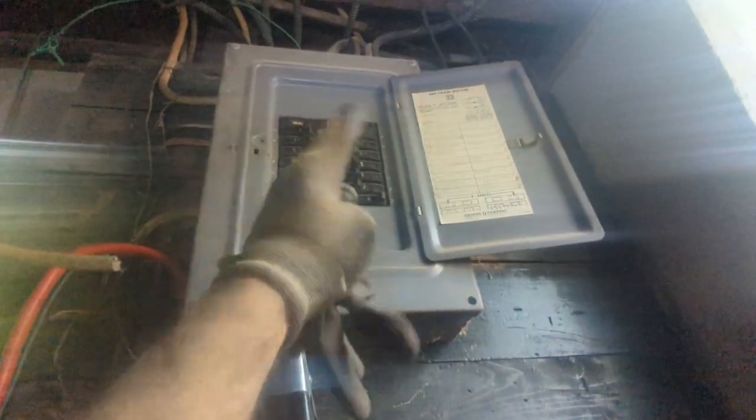This is why I've been making sure, maybe you saw me in the time lapse, that the main breaker is pushed to the inside, and the garage is pushed to the inside. This guy's popped, but everybody else is thrown out from the center and off, because of all the circuits that 10-3, which is a heavier gauge wire for 220 volts, was right in there. I didn't even feel it. I cut it off clean.